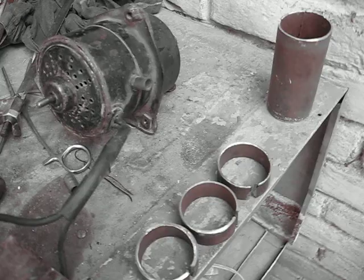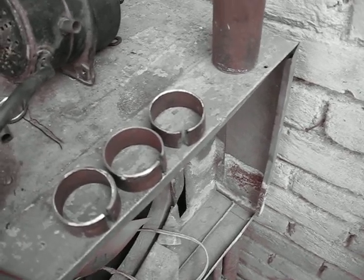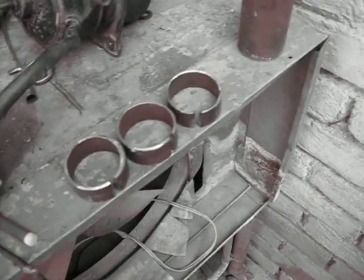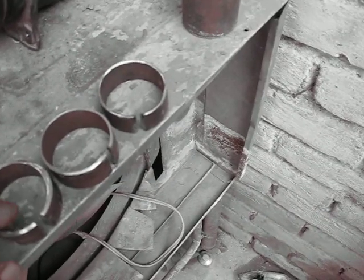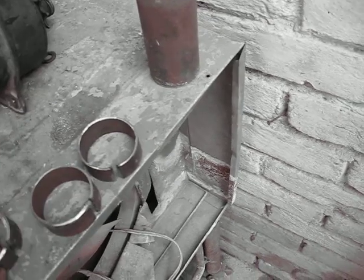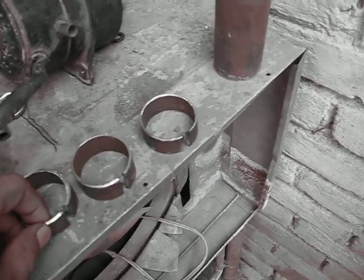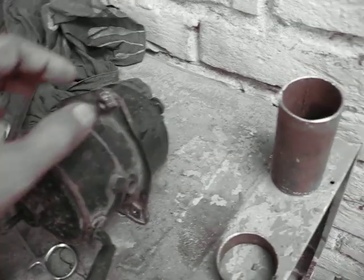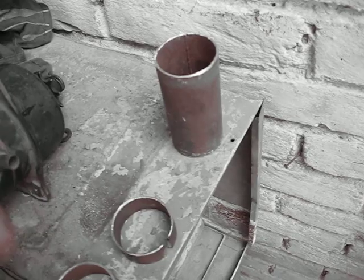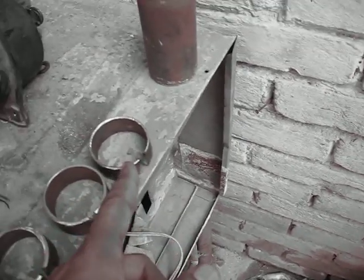What I did was, I did not have any metal — a big strap of metal that I could bend and make a ring. So it would be easy for me to cut this pipe into these three rings, three set of rings. And you see, I have cut the middle portion of the ring right there — the seam over here — and the third one is also like that. Right now I'm going to just straighten it out a little bit to just fix it onto this motor. And when I'm short of it, I'll just weld another ring. And if I'm still short, then I'm going to use the third one.